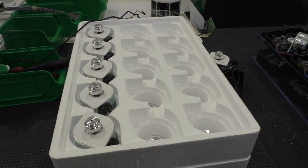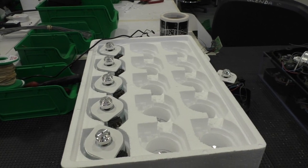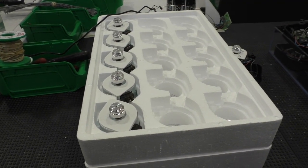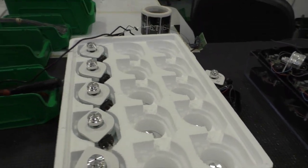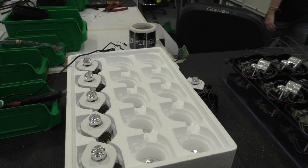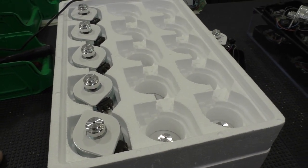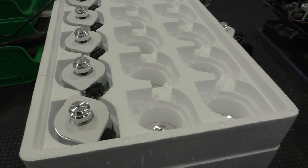Now Rega has moved to exclusive, so 100% aluminum pulleys now. Again, that's not our choice, but when we used to have mains powered motors, you can't do that because it's a shock risk. Actually it isn't, because the motor is double, triple insulated inside, but the electrical approval authorities of the world say if it was possible to bypass multiple insulation levels and someone just happened to touch it, then they could get a shock, so we have to use plastic pulleys. But now, slowly, it's taken a long, long time, we've gone over to using 100% 24-volt motors.